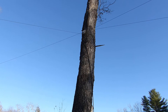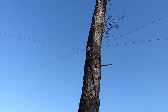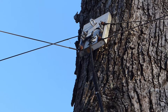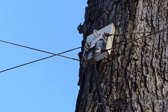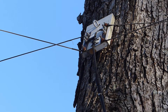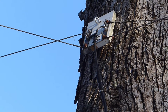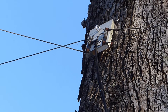You can see the center insulator of the dipole right there. I'll zoom in on that so you guys can see what it looks like. The center insulator is a homemade piece of PVC trim board, and I've got a couple of copper strips there and some bolts going through. You can see my coax is mounted to one of the sets of bolts, and then I've got two legs of the fan dipole mounted to the others.